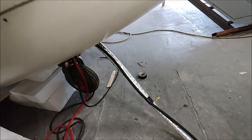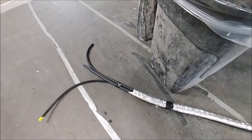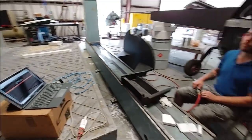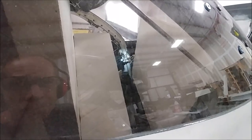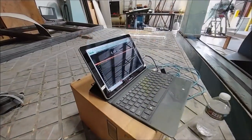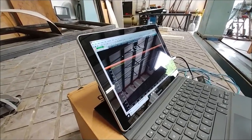Welcome back. Starting out the week, Dan is continuing to work on systems - here you can see he's pulling through the heater lines for the heater core in the front, and also one of the lines for the AC system, and they're going through the keel. I'm working on making some improvements to the door seals so we can get the pressurization up to hopefully five and a half. We're doing another run to see if we can get further. What's happening is the door frames are expanding - I've got a little gauge in there. In sped-up mode you can see how much that door frame is moving - it moves almost 30 thousandths of an inch. With that movement, the seals end up having a larger space and they crack, lose pressure and leak air.